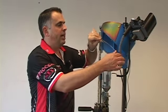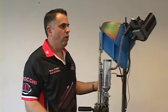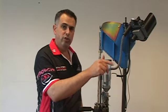So pay attention to that as you set up your 1050, because again, you don't want too much tension on the dropper on the one hand, but on the other hand, you don't want the spring sagging too much to create a trap where the bullets can get stuck on the way down.